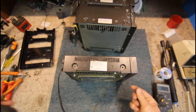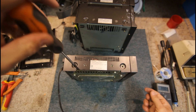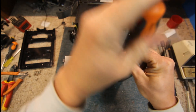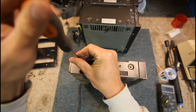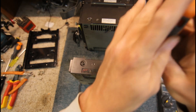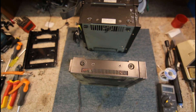Other than having a bit of dust in there, there's probably not much that needs doing. It's probably still running as good as the day it was built. These old Sony Japanese capacitors are pretty good. Some people like to recap amplifiers, but personally I wouldn't touch Japanese ones unless they've been heat stressed. In some hot areas you might want to check them, but these old Japanese capacitors are amazingly reliable, and I'm loathe to put in modern high-temperature caps, which most of them aren't particularly good quality.